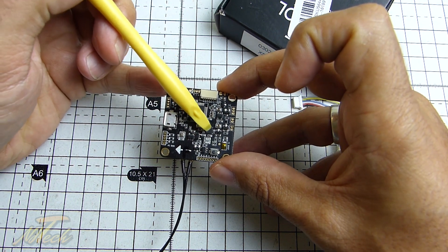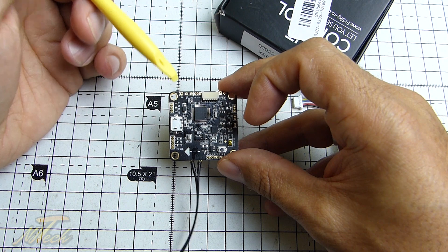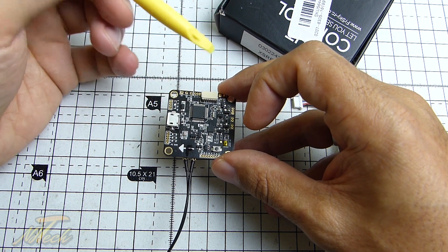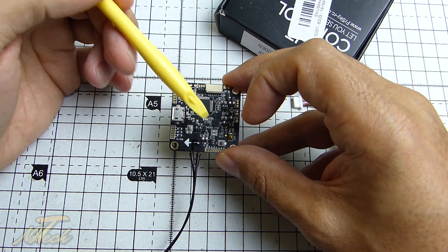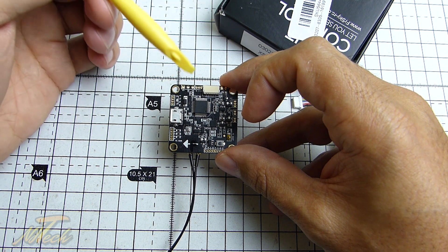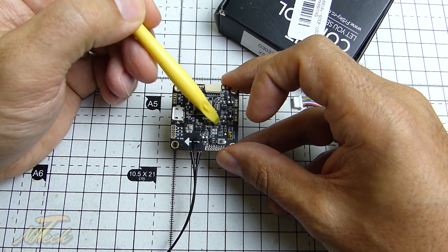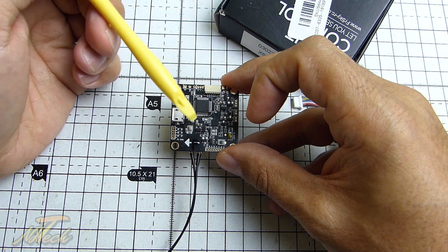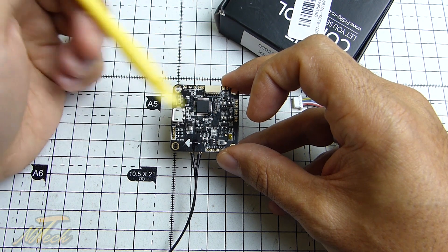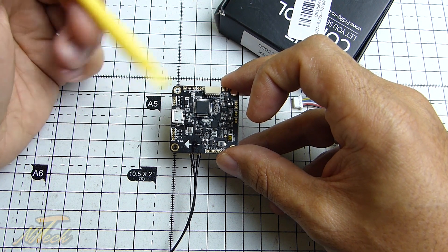Just off centre there is the actual gyro. Speaking of the gyro, it is the 9250, which is basically a 6500 gyro — the more noise-sensitive one that can give problems. It's not my favourite gyro; I prefer the 6000, and people like Boris have quite openly said the 6000 is really the one to go for. It's certainly the most favourable of the gyros right now, but the 9250 is based on the 6500 — it just has the addition of the compass and barometer built into it. That said, all you have to do is be a little bit careful with your soft mounting, and it's certainly very flyable. You can get great results out of the 6500/9250; I certainly have in the past.